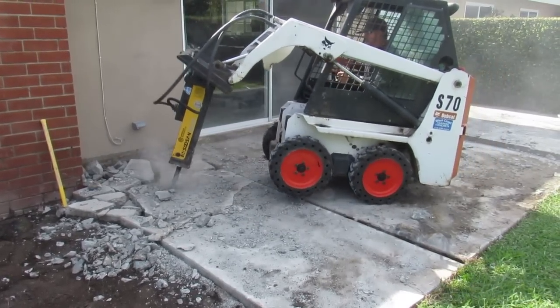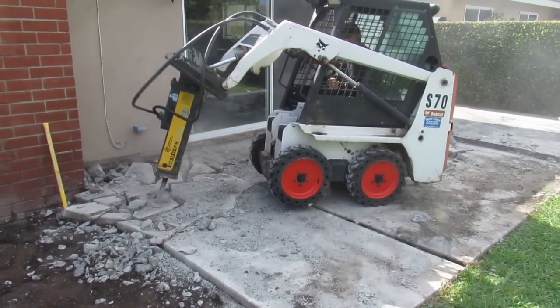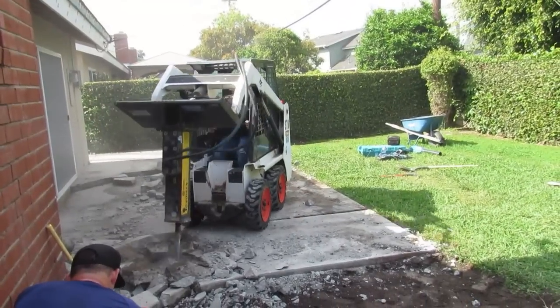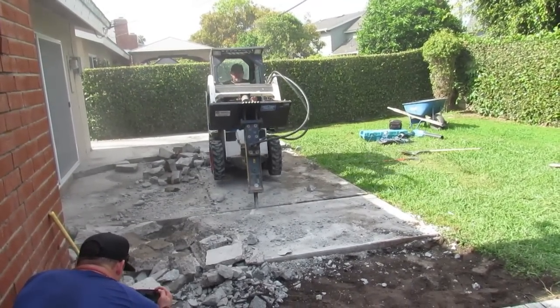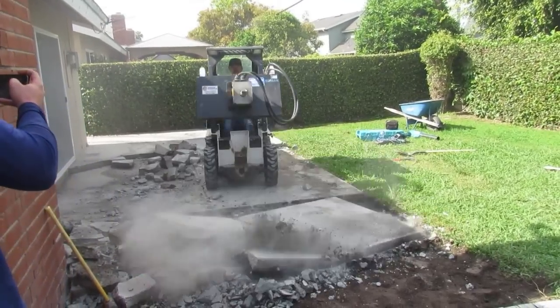It's like ordering concrete. I always order a little bit more. There's too much money on the job to sit there and save $200 for a yard or whatever it is. It doesn't make sense. Because then it ruins the finisher's day. They're home in the dark, and you're waiting for the next truck, and God knows when you're going to get it. So I just lift it up and let it break.